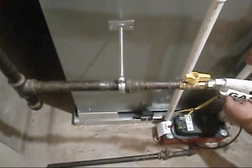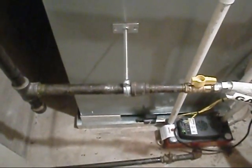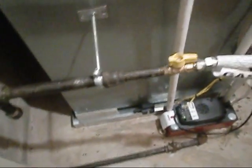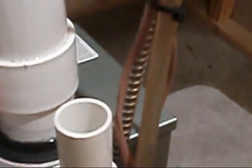Alright y'all, we're still on Rudd Installation 2 but we came back over to Rudd Installation 1. I wanted to rework the gas — get a nice gas cock on here. I also wanted to put one of these standoffs so the gas pipe doesn't move. Also brought that up too, Dallas. And we are removing the cap for static pressure.